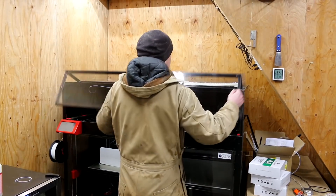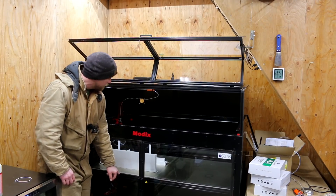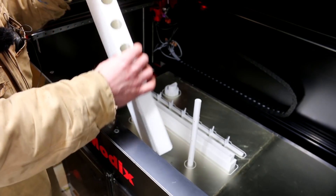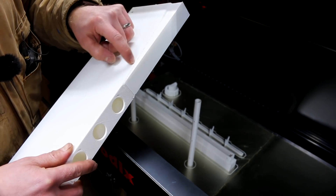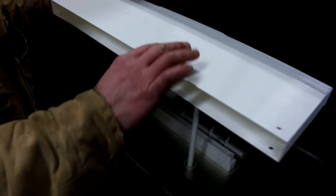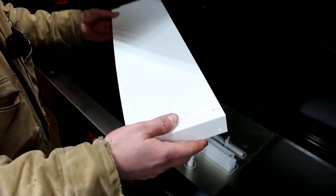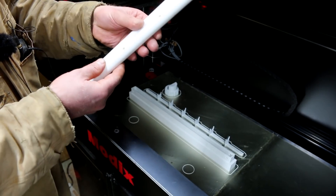We have a successful print completion! Look at how far down the bed goes and it's still got another foot and a half to drop. Here is the base — nice. The part that came up were supports. Where it meets the supports that doesn't look very happy — I might have to do some cutting and sanding there. This line is where we ran out of filament, and there's a little bump right there, but once it got over that filament loss everything turned out all right. That's going to work.